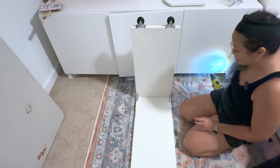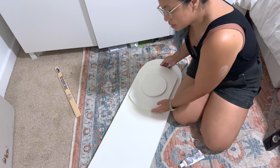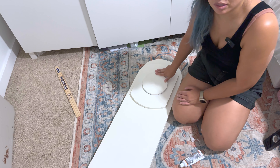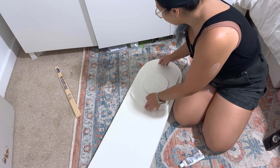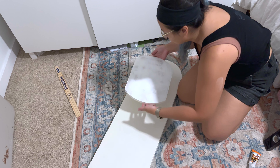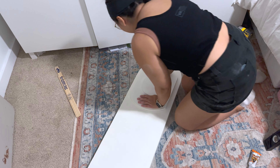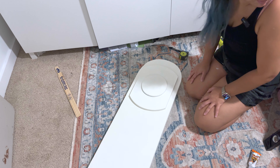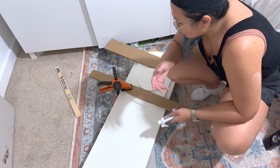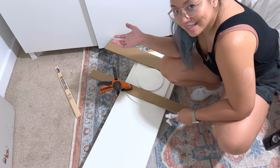I'm freaking stoked — this is coming together! To attach the lazy Susan to our table, I'm going to use construction adhesive. Normally I'd like to screw something here, but since the door is hollow there's nothing to screw into other than the edges. So this is just going to go in the center. We'll do a bead all the way around, flip it over, and line it up. To hold it together, let's clamp it. This will take overnight to cure and harden, so we'll leave it clamped and see you the next day.